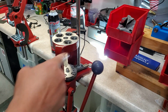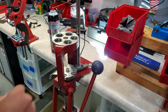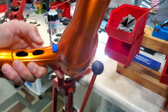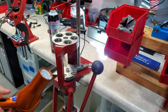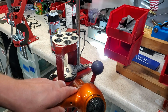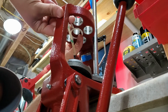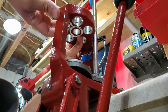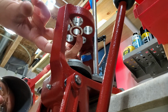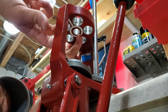Now, my LED light's been on for about 10 minutes, so I'm sure the adhesive on the back of that light is warming up, but you need to warm up that press steel a little bit. So I'm going to do that with a hairdryer. Now, before I pull off the backer of this adhesive, I'm just going to do a quick dry run here just to make sure that my game plan is squared away and that this LED lighting is centered on the arm of the press itself.